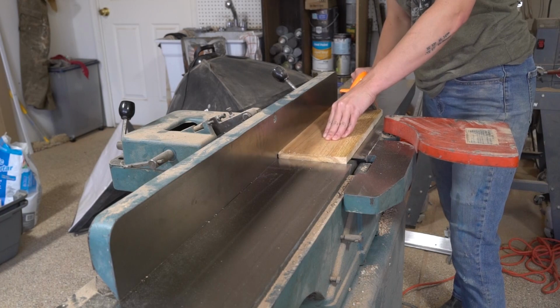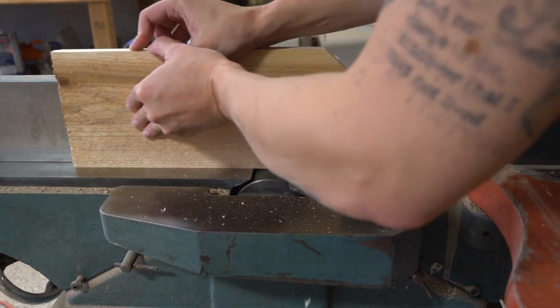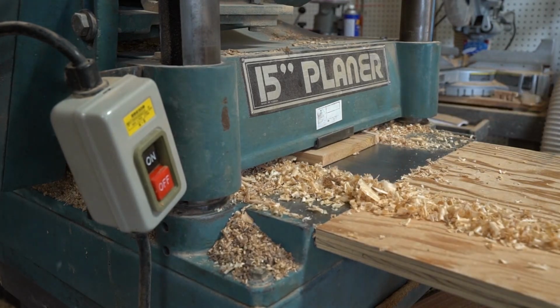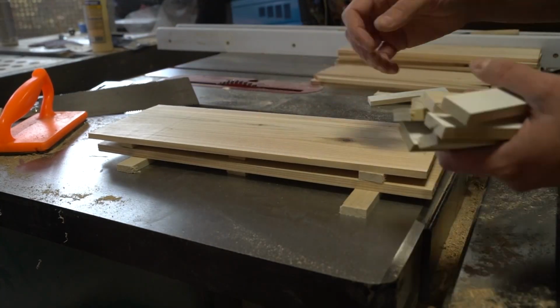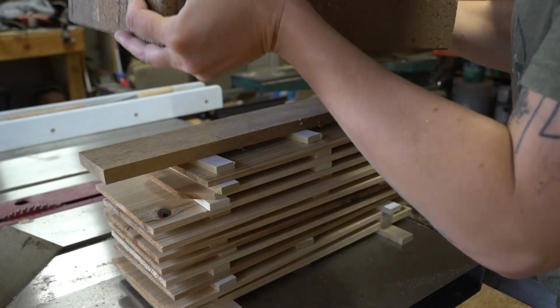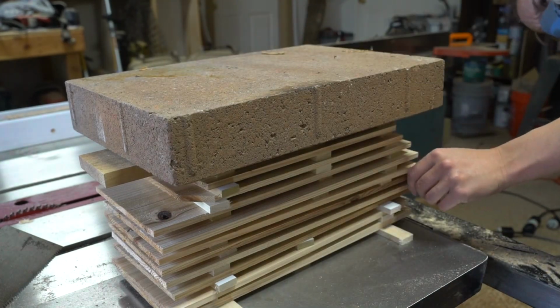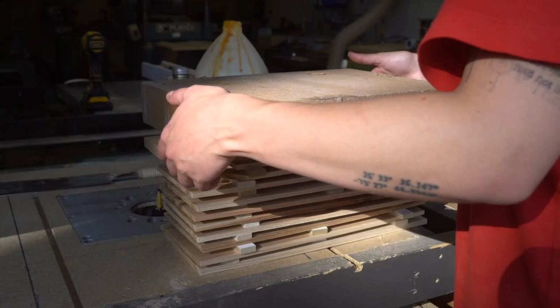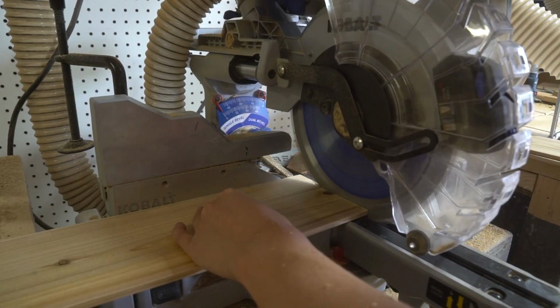While the oil cured, I got to work on the cedar inserts, firstly by squaring the pieces. Because they needed to be so thin, about 1/4 inch, and were made from a coniferous tree, after getting them all squared and dimensioned, I stacked and prepped the pieces, and then let them rest a few days before attempting to make shapes with them. Once well rested, I cut them down to size to fit the interior faces of the box.